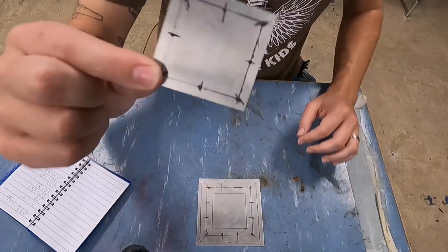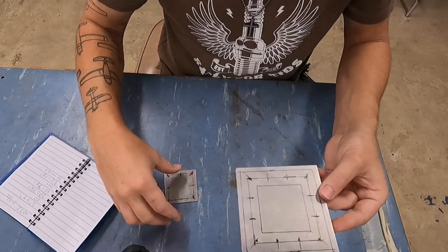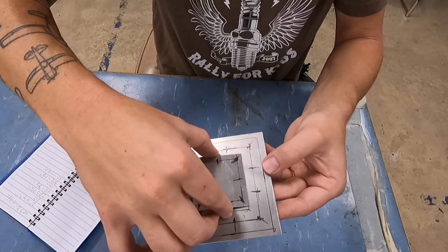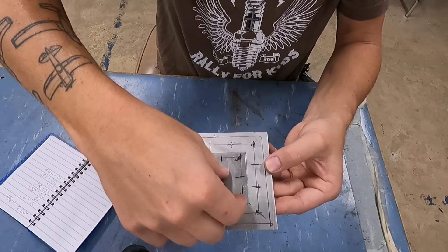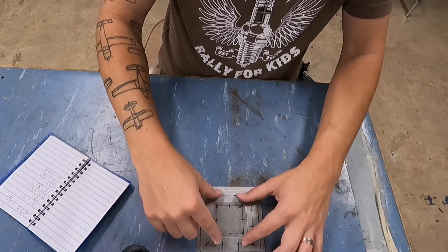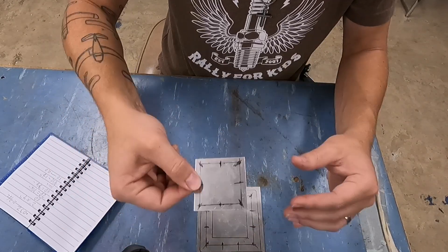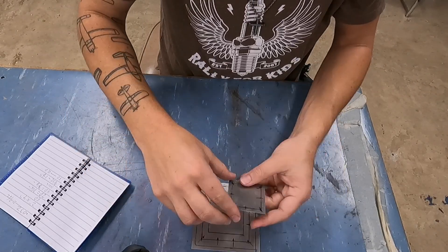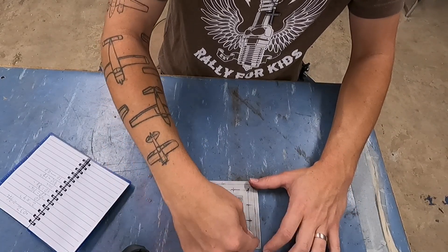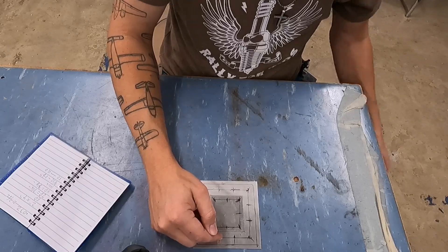For this demonstration, I did the smaller piece at the minimum of 2D and the bigger piece at the maximum of 4D, just to show you what that would look like. So this edge distance here, from this edge to this line, is 3/8. And from this line to this line is 3/8. On this smaller piece, my edge distance from the edge of the plate to here is about 3/16. What I would do is lay out exactly like I did and draw these edge distance lines first, then put a rivet mark on each corner, and trace out the scab with an edge distance line on each side. This total length of this flap should be about 6/8 or three-quarters of an inch.